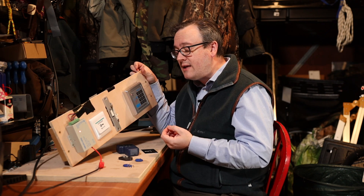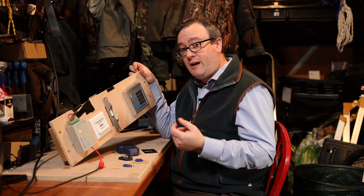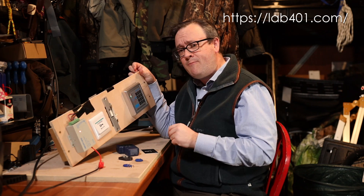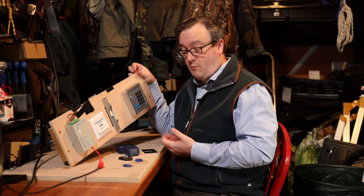Interestingly, I was dealing with a system recently which was using DESFIRE EV1 cards. They were very proudly showing it off — it was going to stop people like me replicating the old MIFARE Classics they used in the past. But what they'd done was replicated exactly the same problem onto a much more expensive card: they were just using the DESFIRE EV1 serial number to authenticate. All it meant was I had to go to Lab 401 and buy a DESFIRE emulation card. You can't copy DESFIRE cards like you can with MIFAREs, but you can emulate the serial number — so with a 35 euro card you could bypass the system instantaneously.